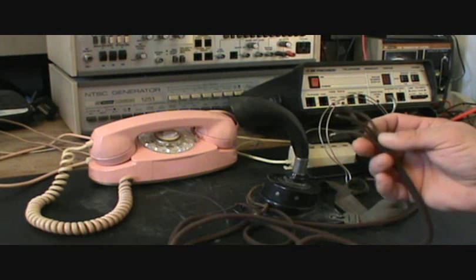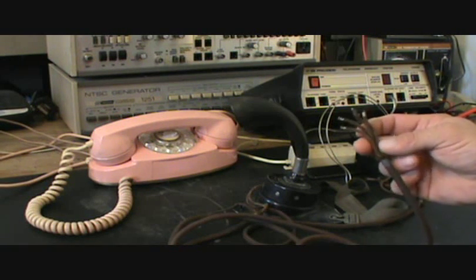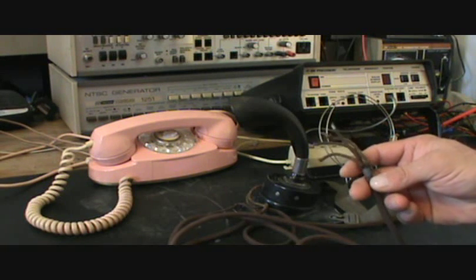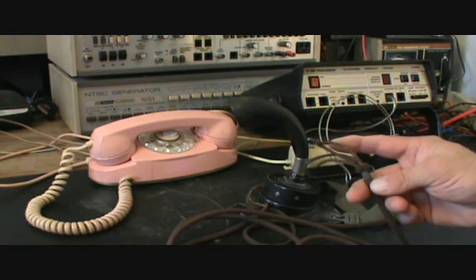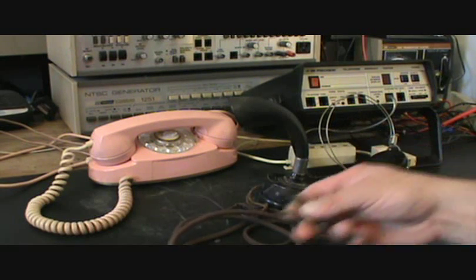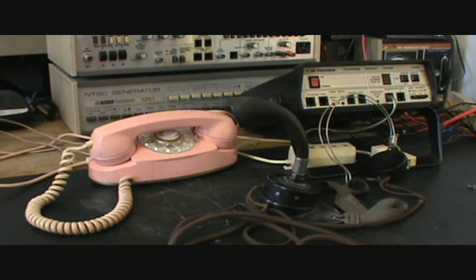Since the line cord is too big to actually get a modular port plug adapter on it, what we're going to do is pigtail onto this line cord, and then that will give him a short piece of modular plug that he can plug into the wall anywhere. So this is the initial checkout of this equipment.